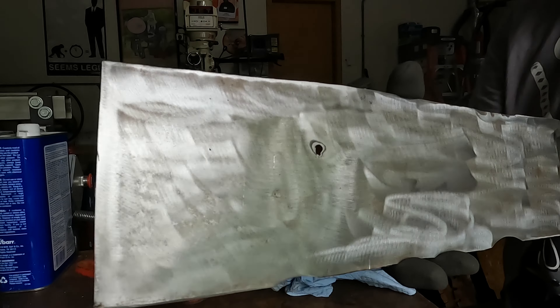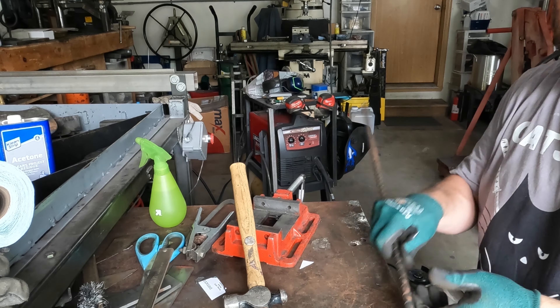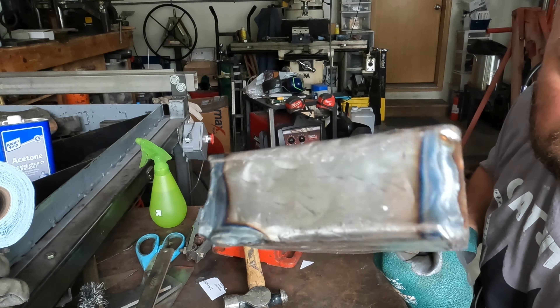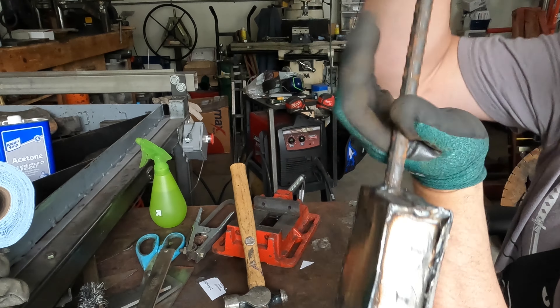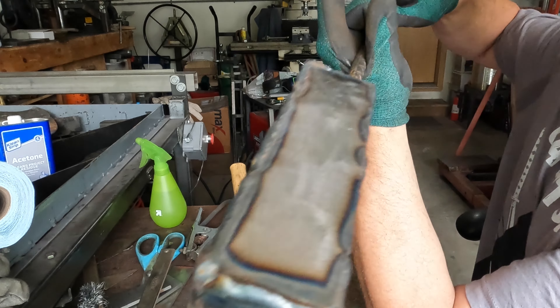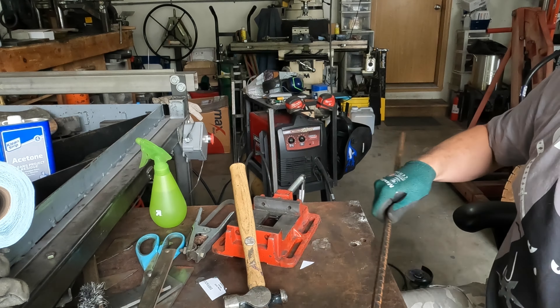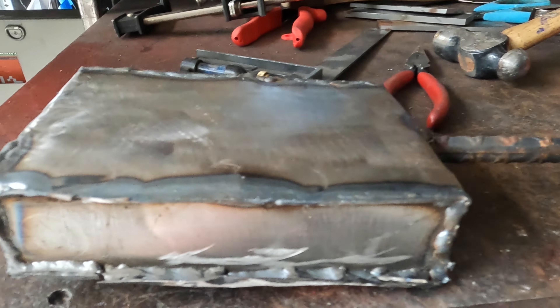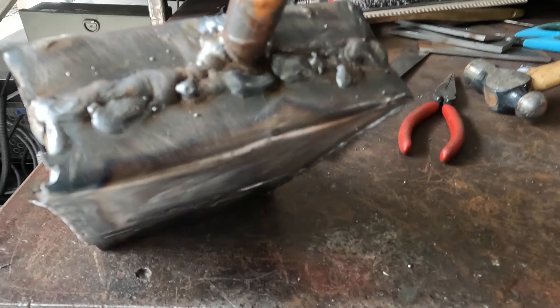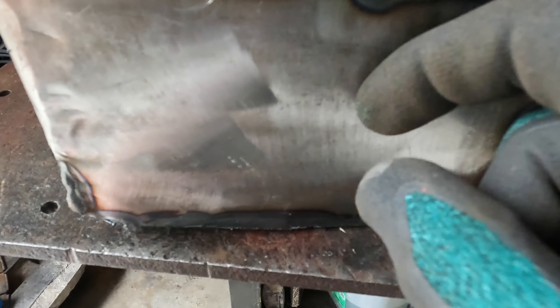I'm using very light gauge sheet metal — 20 or 26 gauge. It's very thin and will just fall off as you're forging. I've wrapped my billet entirely in sheet metal, encased it completely. I welded the back shut and welded a rebar handle on it, so this is completely sealed. I've placed a piece of paper inside, which will burn and consume all the oxygen that's inside there — one on each side between the stack and the sheet metal wrap.